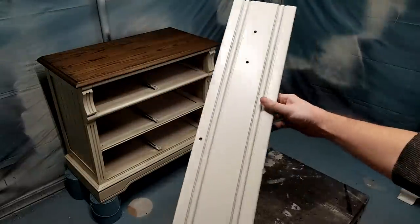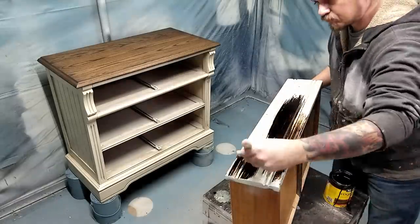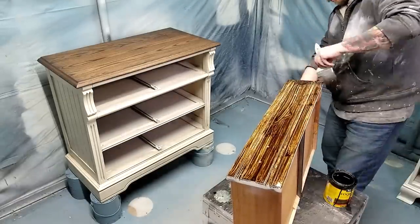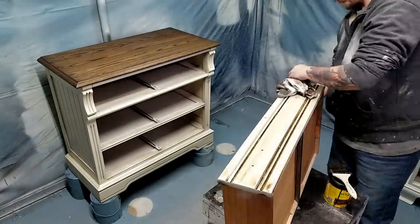With the base finish, I can move on to the drawers. You can see where I got the stain on it earlier. Oil-based wood stain will re-wet itself when you apply it over it again, so this is something I didn't have to stress out about earlier. I can just apply more wood stain on it, wipe it off, and keep going.